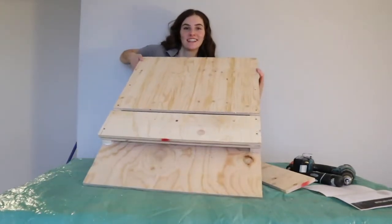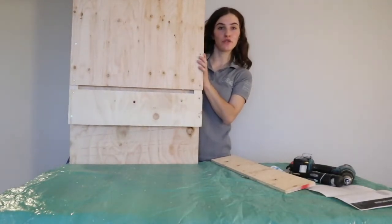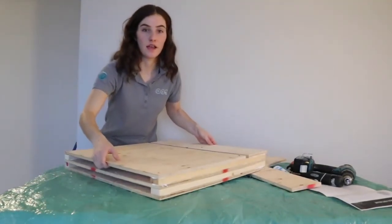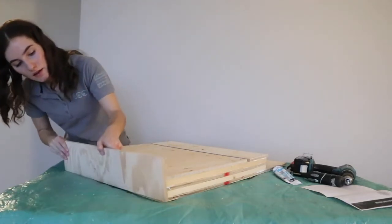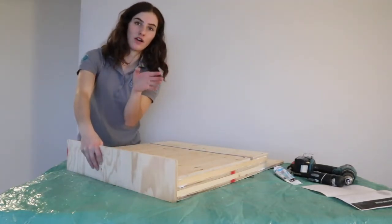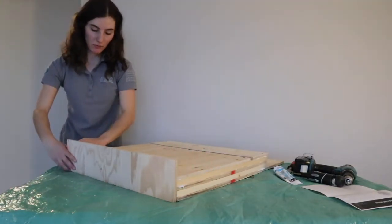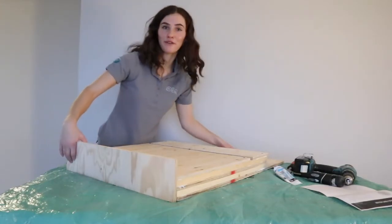Now once you have it all screwed in, your box looks pretty good — we are almost done. We just have to put on the roof. You can either put the roof on with it standing up and drilling down, but for this video I'm going to lay it down flat. Take your smaller five-inch wide piece and place it flat on top of the box. You'll have about this much of a lip hanging off so that when it rains the bats don't get wet — a runoff effect. Make sure it lines up nice and straight, and we'll put some caulking around the edges before we do the stain.